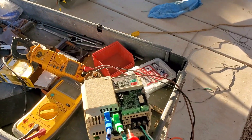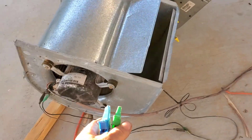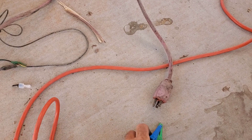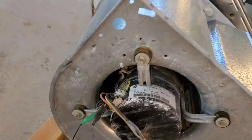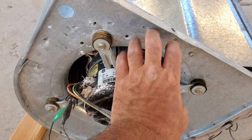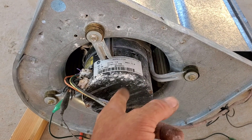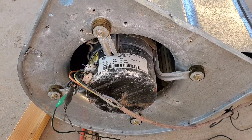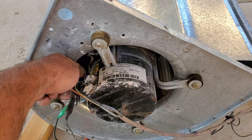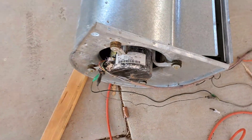Okay, enough of that — disconnect. Now I'm really gonna blow your minds. We're going to connect DC power — 300 volts DC — right to this plug. It's a wall plug because I had this ECM running on 110 volts going into there. I thought of this about a week ago, plugged in my DC, and it had all sorts of snapping sounds coming from inside. It was set up for 115 volt and I forgot to cut the jumper, so it blew the surge suppressor in there — but it did not blow all the electronics out. It still worked when I connected it back to AC power. Today I just cut this jumper. We're not going to hook 220 volts AC in here — we're going to put 320 volts DC.